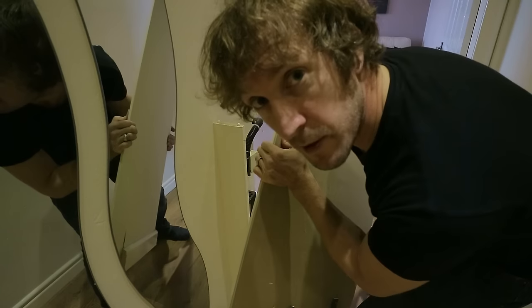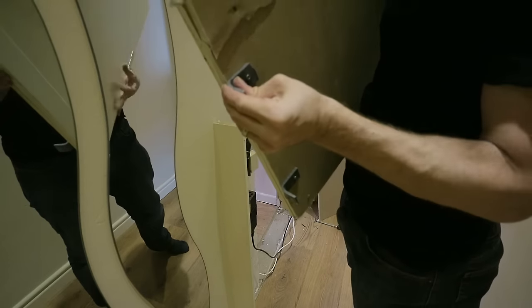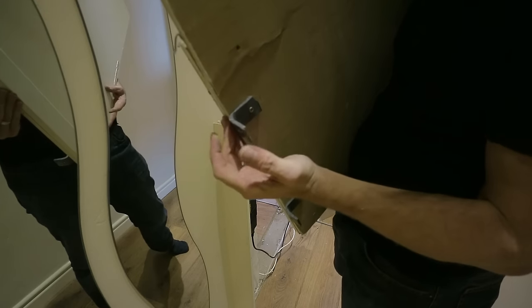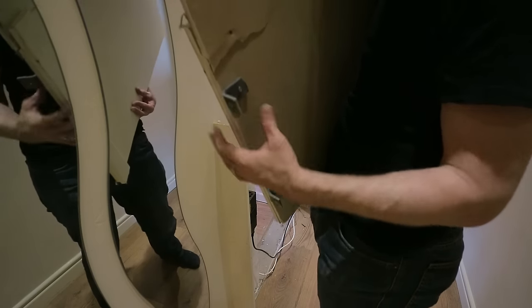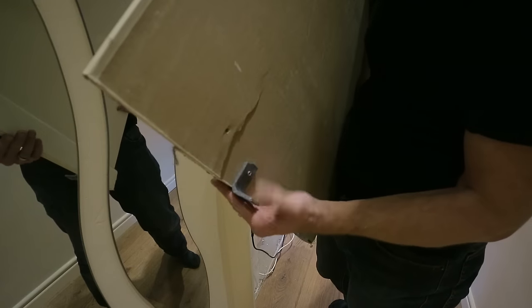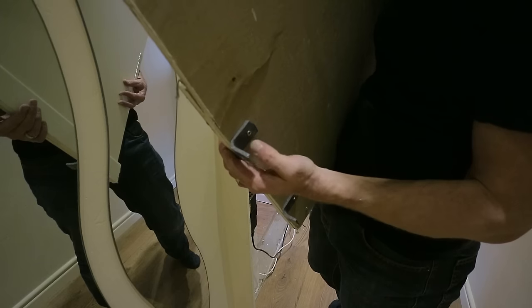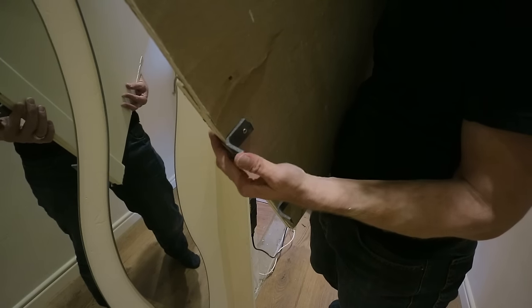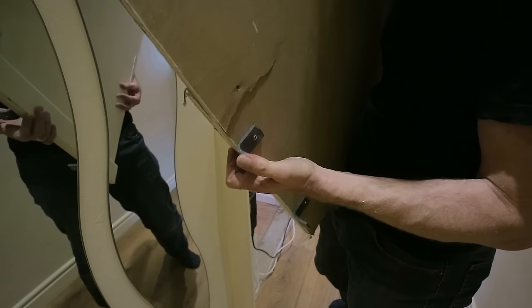By the way, in case anybody's interested, these brackets are homemade. I've got some plastic in the garage. It's really easy to cut and it's very handy because for jobs like this where you need something quickly, you can just make things up without having to go to the shop. So you cut the size that you need and then you can heat these and bend them. I heat them with a heat gun or whatever you've got. Then you can bend them 90 degrees and then when it cools down...